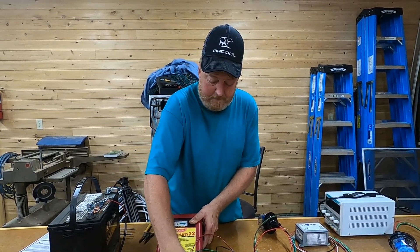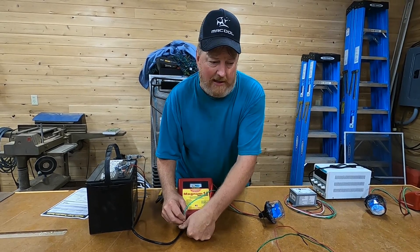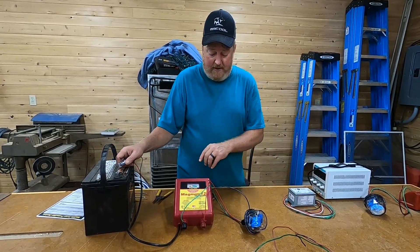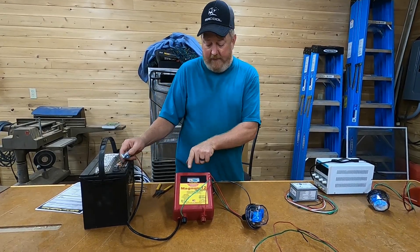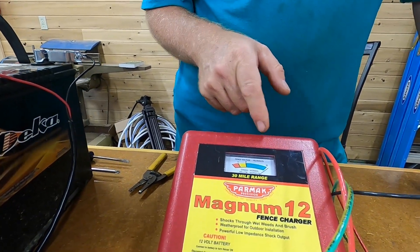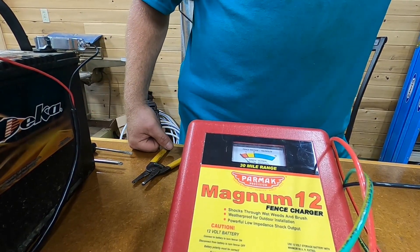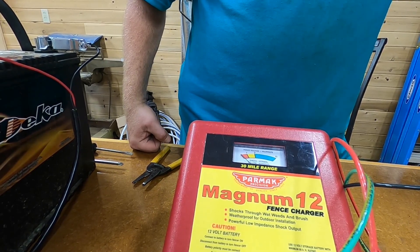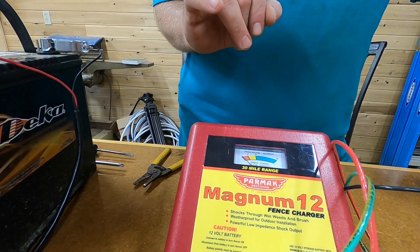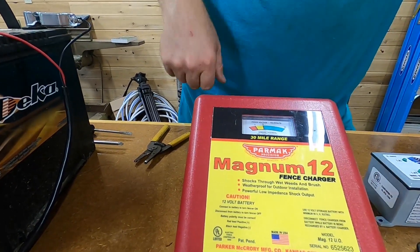So now let's do the Midnight — this is the Midnight 300 AC, just to be clear. The 300 AC and DC are the same; they just light the LEDs differently. These have LED indicators that tell you they're working. So now we're going to hook this up. I'd expect it to charge up, but then I'd expect it to tick and never come off the zero mark. So it's charged up. Now it should drop down. If I'm really quiet, you can hear it ticking. And you can see the needle doesn't even twitch when it ticks. So that's conducting and holding that voltage down to a really safe level for all your equipment.